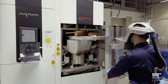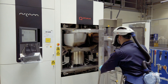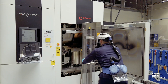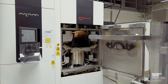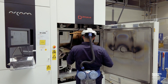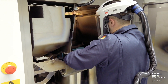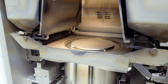Now Steph's going to be putting the powder into the machine. In this build it was fully topped up to 200 kilos of powder, though you won't necessarily need that amount — this build is only going to take it up to about 270 millimeters. The machine's max build size is 350 millimeter diameter by 380 millimeters in the Z stroke. Here he's just inserting the base plate — he's gone for a circular base plate, which is down to the size of the build.